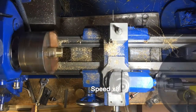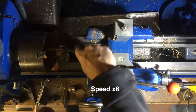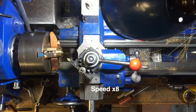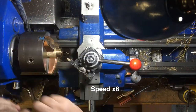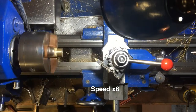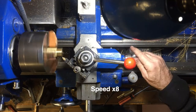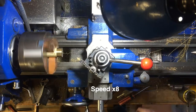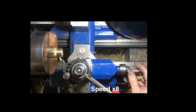You may have noticed that the other bolt had a spherical dome on the top. I'm now wanting to make a similar dome on this bolt, doing it by making a series of cuts of different depths and lengths to make a pyramid-like shape on the top of the bar, then using the compound slide to make a bit of a slope, and then I'll use a forming tool to finish it off.